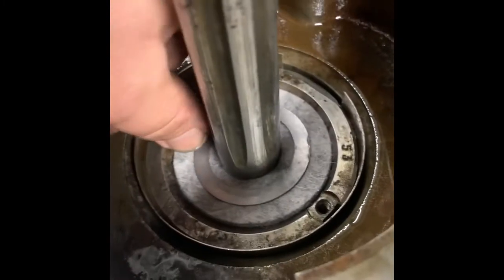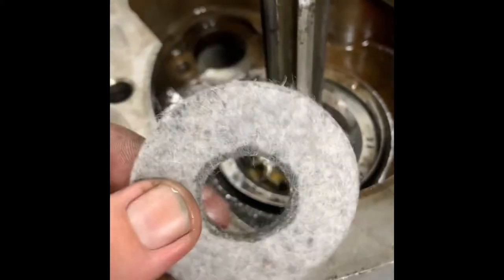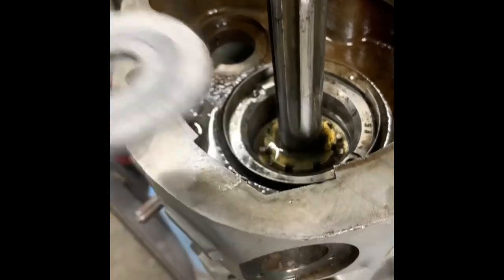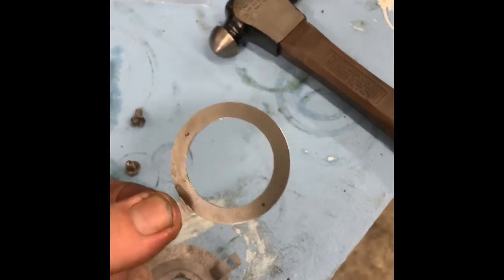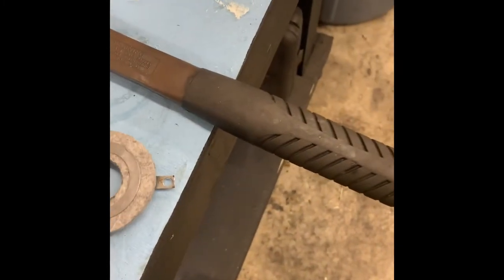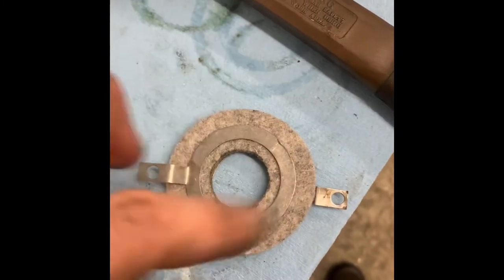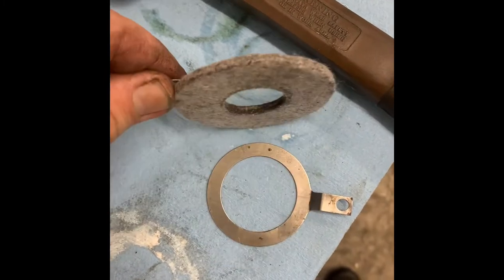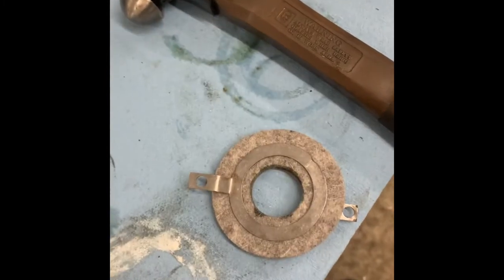The problem — and this has only happened once to me — is that this felt wiper is glued onto its ring, not fastened any other way. One time I shipped a machine out and the felt wiper got sucked down into the spindle. So a little trick I do: I take the old ring, remove the felt wiper off it, and put it on top of the quill first. Then I take the new one and put it on second. That sandwiches the felt between the two rings and prevents that from ever happening again. I ended up having to have the head shipped back and it cost me money to fix it under warranty.